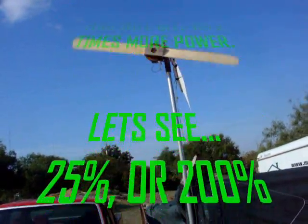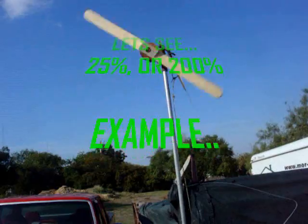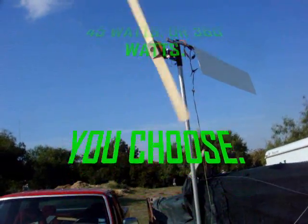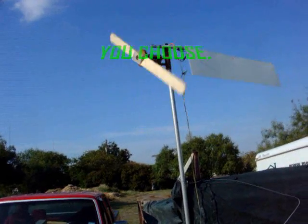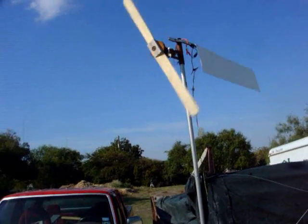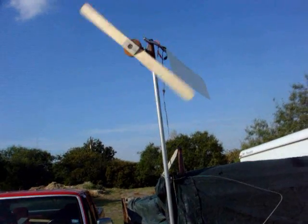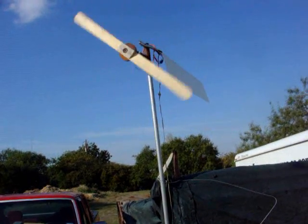Another thing you've got to do is curve the front of the blades and sharpen the back end of the blades to make them quiet — plus the tips have to be rounded. That's really not that loud at all. It's spinning nice. I'm Scott Brown, Green Wind and Other Home Energies. Many good things to you and yours.